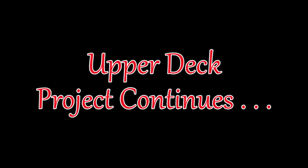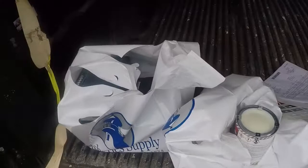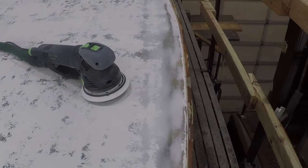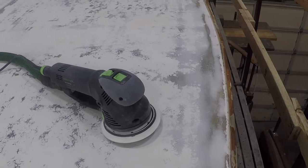It's Saturday morning and we're here at Seattle Fisheries — the boat remains in Port Townsend so we're working here. I got a new Festool sander that we'll try out next week. Also picked up a bunch of sanding papers and the six different items needed to do all the All-Grip paint on the upper deck waterways, which we'll start on next week. I'm working on the upper deck, sanding around the edges in a pattern through the middle where we're going to have All-Grip oyster white paint. The fiberglass guys left it at 80 grit, then I did 120, then 240, now starting 320 grit along the outer perimeter, and then we'll be ready to clean and start masking.